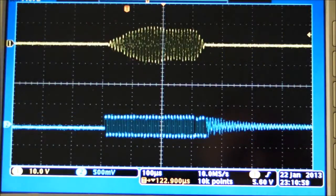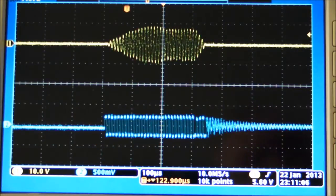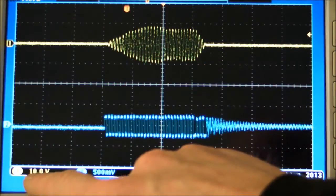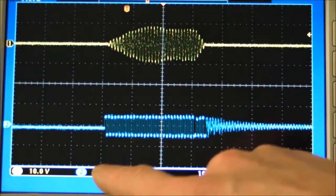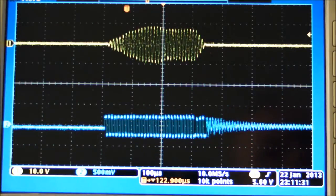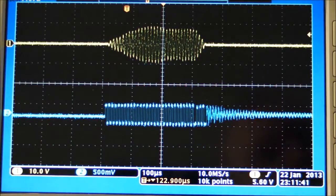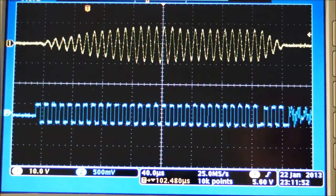Look at that — that's exactly what I'm looking for: a nice clean square wave going all the way across. This is the primary current — multiply by 10, we get 100 amps per division. On the voltage channel, multiply by 1000, so we get 500 volts per division. You can see it's going plus/minus 250 volts or so. That's exactly what I want to see out of this high voltage probe, so now I'm going to put it on the rotary spark gap side and see what we get.